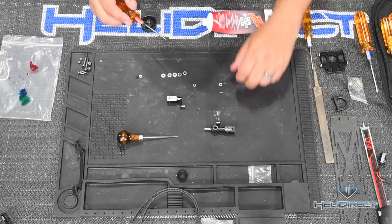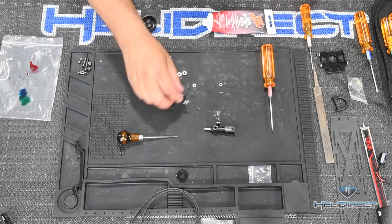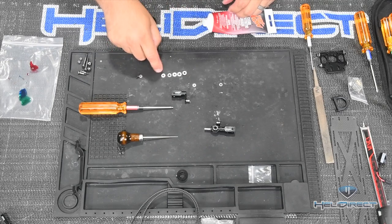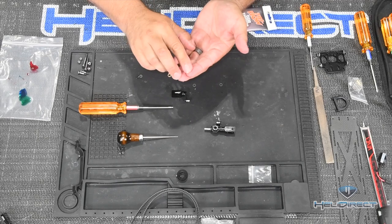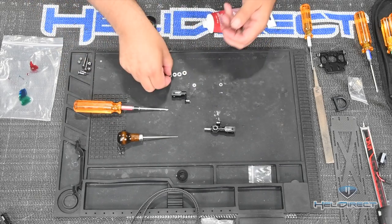So now we've got our one blade grip. Again, this is that extra shim that I don't know if we need yet, so I'm just going to leave those out of the running for now. All right, we're going to repeat the process working from the outside in on the other side. Same rodeo. I've already checked these thrust washers, so I know that this is the smaller inner diameter thrust washer on the outside there. So that'll go onto my driver first. And then we've got the cup washer.